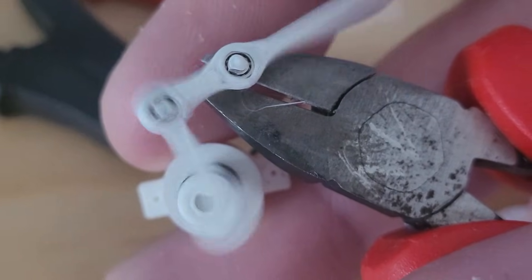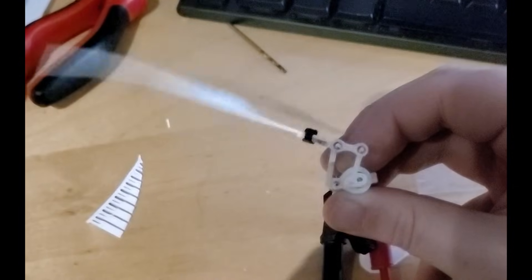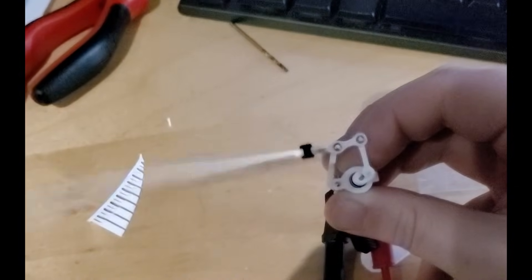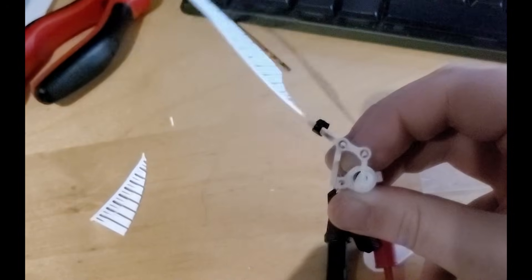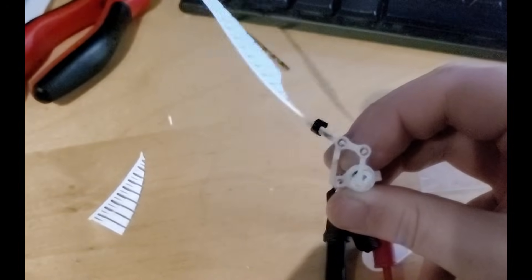I originally tried a 1200 rpm motor, thinking more speed equals more better. But it couldn't deliver the torque I needed — the motor was not quite powerful enough to overcome the inertia of the wing itself. So I went for its shadier but admittedly cooler brother: the 420 rpm motor. It is a bit slower, but it does the job quite well. It is able to overcome the inertia of the wing and rotates smoothly.